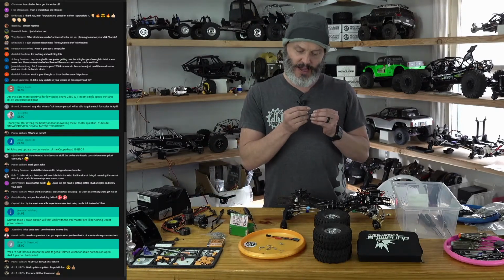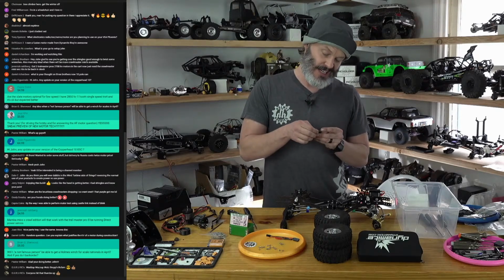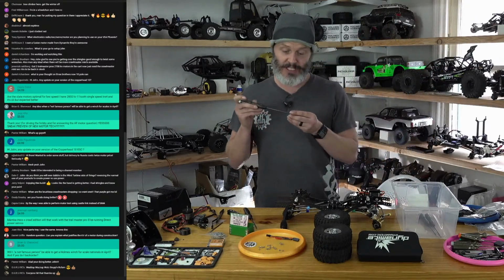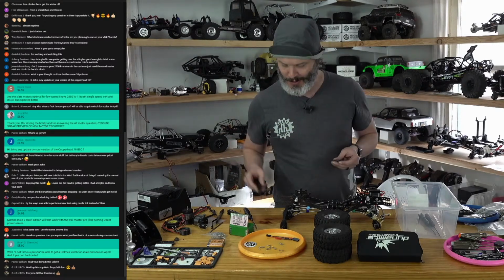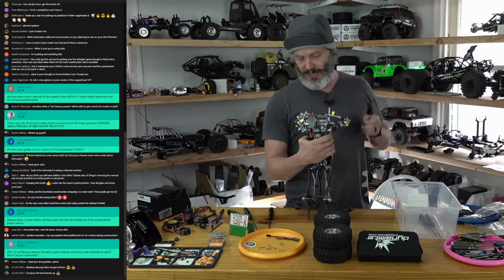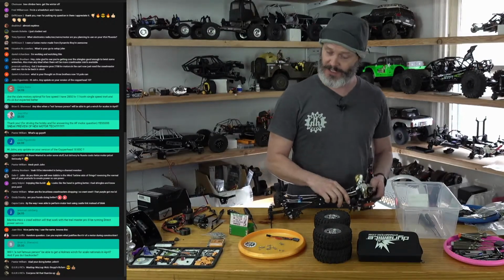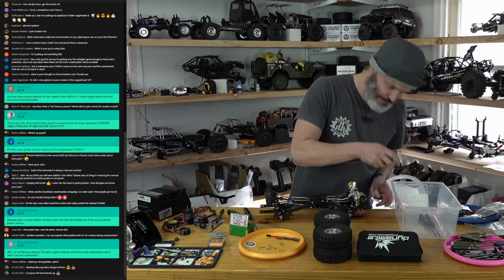When you are driving it that way, though, you do get voltage drop inside of the motor, and technically the kV is an ideal spec and not an actual measurement. That's the other way to get a kV from a motor: you spin it up and it says, hey, I got 10 volts and your controller is making me spin 10,000 RPM, so the equivalent kV is 1,000 RPM per volt.